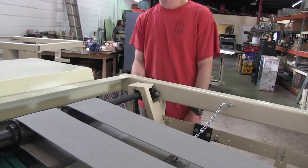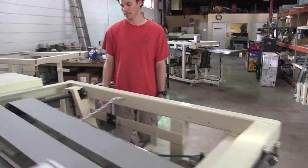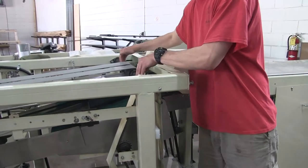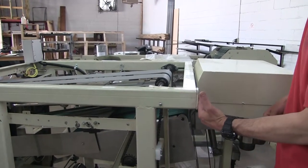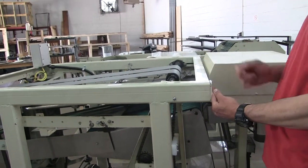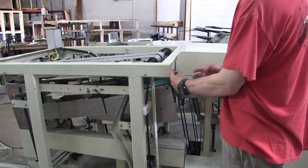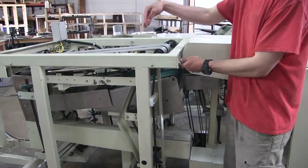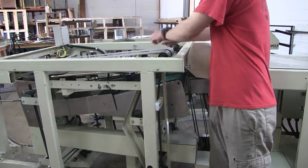Once I've loosened everything, this bolt right back here on the back side of the machine is what we're going to adjust in order to tension this up. I'm going to take two wrenches — I believe they're 9/16ths. I'm going to grab this jam nut and hold it in place, then I'm going to turn the other one clockwise. What that will do is pull this entire bolt out and pull this shaft back, which in theory will put tension on both of these and cause this belt to walk back the opposite direction.